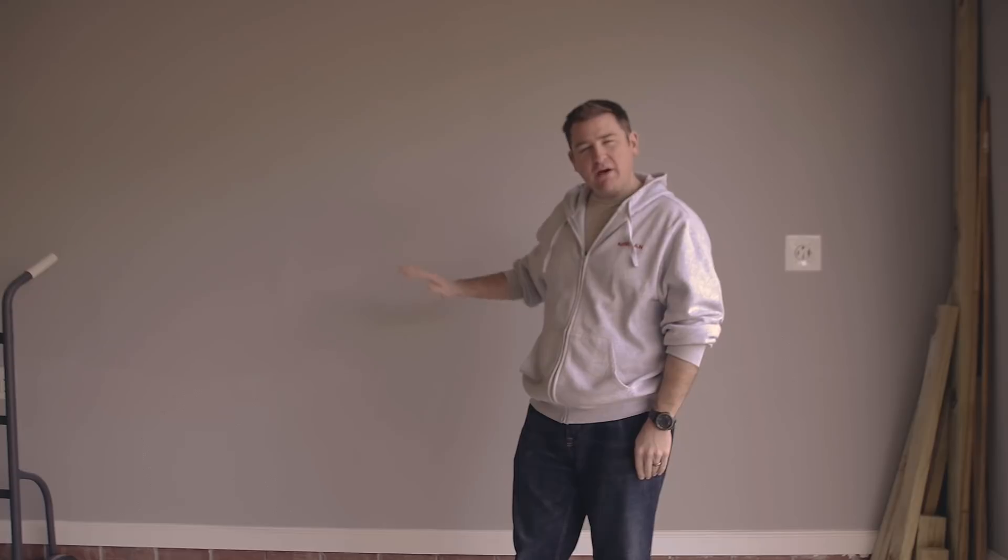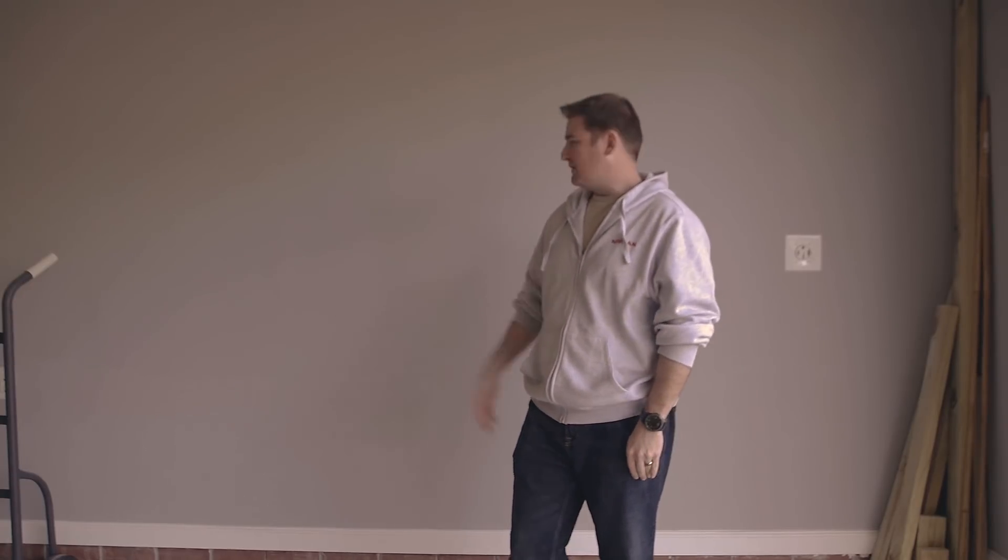Off camera I got the mud finished and let it dry, did the sanding, got it nice and smooth. The wall still had a little bit of wave in it, so I hit it again with another round of mud, let that dry and sanded it down. Once it was all done, took a damp cloth, wiped off all the excess dust, then got the paint out and hit it — and it looks just like the wall did before we started. The outlet has the plate on and looks nice. Any questions or comments, put them down below. This is the first part in a multi-part series where we'll be doing a bunch of electrical stuff around the house, so subscribe to the channel and come on back. Thanks, see you next time.